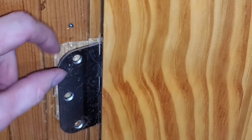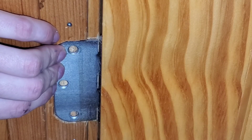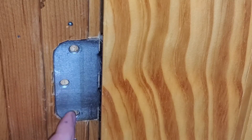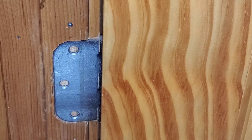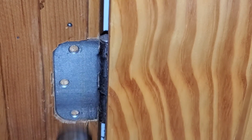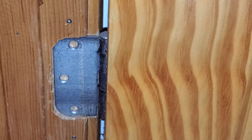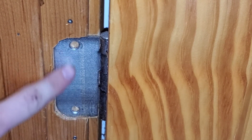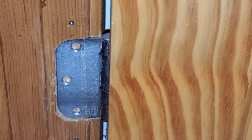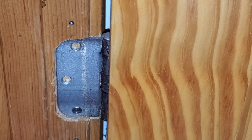About 10 minutes later, I got it pretty well. I kept the other hinges connected so I don't have to take the whole door off. I put it back in — now I've got to sink the hinge first. Got to make sure the door's open. There, back into the hole — it doesn't look that bad. It's just sunk about twice as deep as it was. And now, when we're done, the door should not hit anymore.